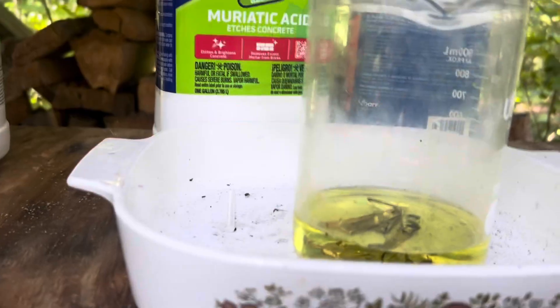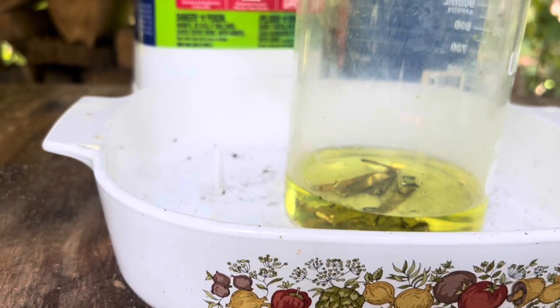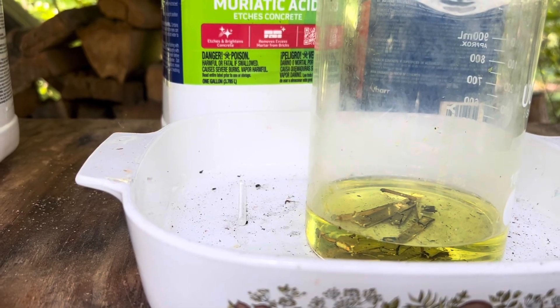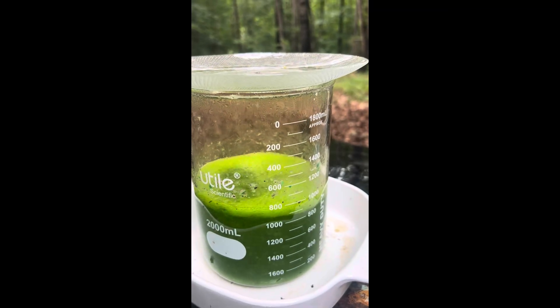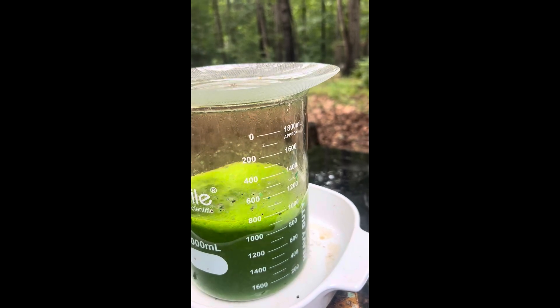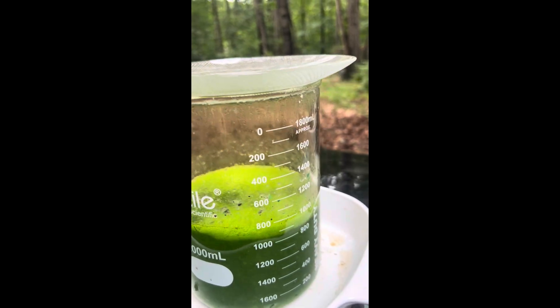And here were some stubborn foils. I put them in hydrochloric acid and we'll add a little bleach. This is the gold-filled foils — we're boiling that down in aqua regia. There's still a little bit of nitric production there.